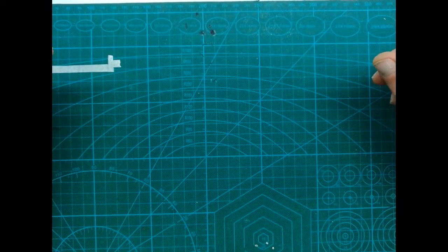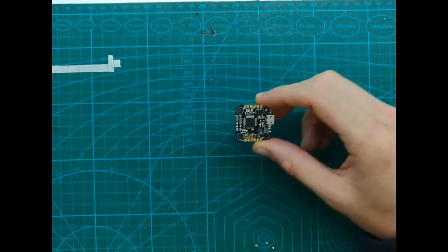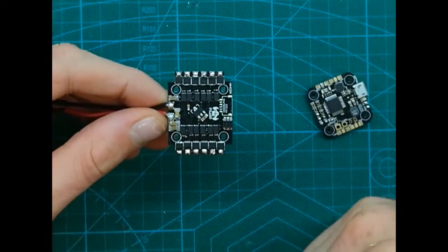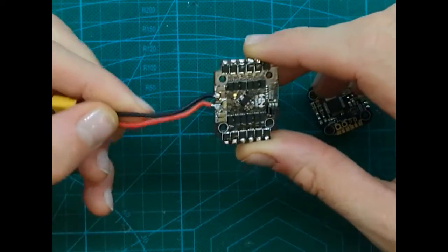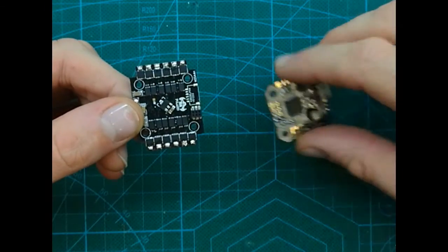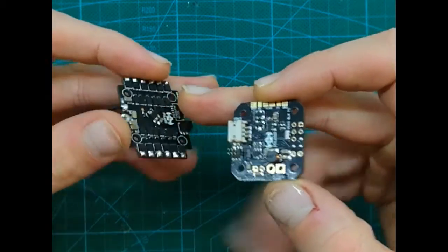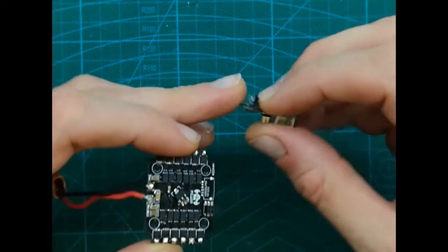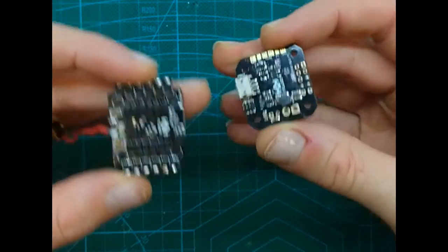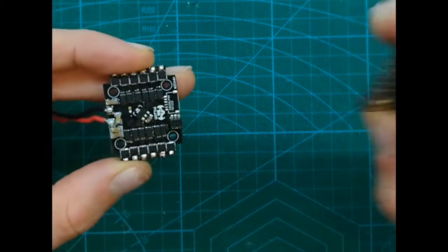Welcome back. Let's look at the flight controller itself. We know about the PCB board and the ESCs — which is the front and rear and where to solder the motors. These are the main battery solder points. The PCB board and flight controller correspond through these pins, so when I plug the battery, the PCB board will power the flight controller and they will communicate using these pins. That means we do not need to solder any additional wires between this board and the flight controller.